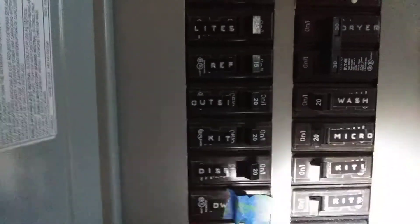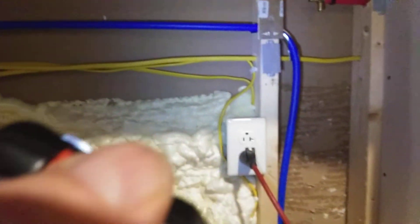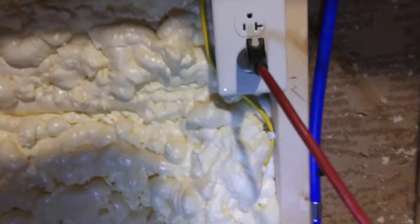You wire up a 120-volt dedicated garbage disposal circuit — 20 amp — meaning there's nothing else on that circuit. I put in a new 40-space 200-amp box, and right there is the disposal's dedicated 20-amp circuit. That cable runs from that breaker down into the single-gang outlet, bringing 120 volts into the single-gang box.